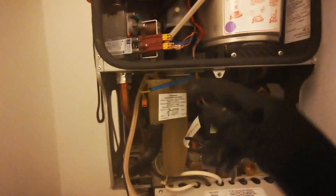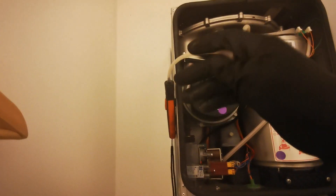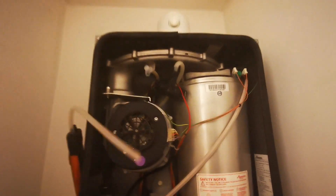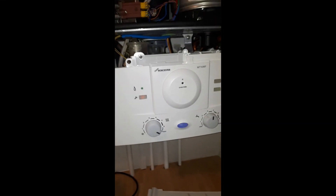First thing to check: your manometer or U gauge hose — make sure it makes a tight seal on the test point and your U gauge, and make sure it's not kinked or has any splits. Secondly, the fan itself — does it sound like it's running on high fire? It should be running a lot quicker and noisier.